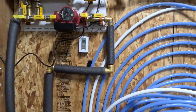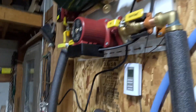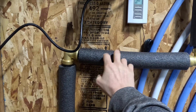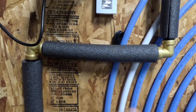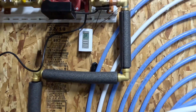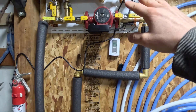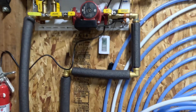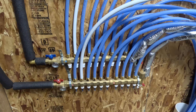Okay, we got it in there — she's definitely a bigger pump. I had to take this bracket and move it over, and I had to put a different piece of PEX, probably about this much longer, to get it to fit. She's running right now — no leaks. But I thought I had the system bled well enough and when I turned the snow melt on you could just see the air pump right into the line.